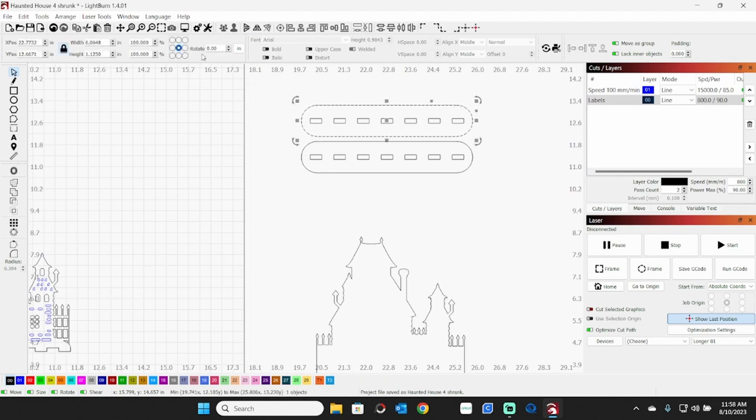Select that. Oh, I guess I didn't group that before. We'll reselect these here, and we need to change that height. And make sure your padlock's unlocked here, or you'll screw up your tab hole the other way. Change that to 0.22. The same thing down here, 0.22. And what I'm thinking about now is to regroup these so that we don't lose anything. Hit save, and we're ready to laser.